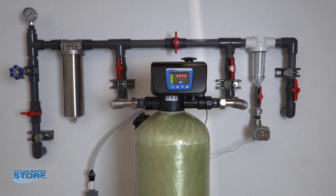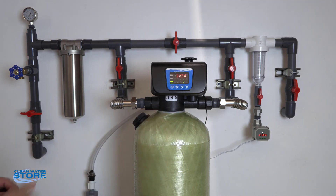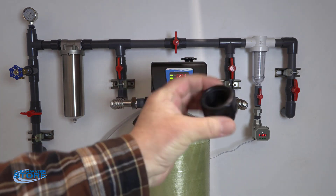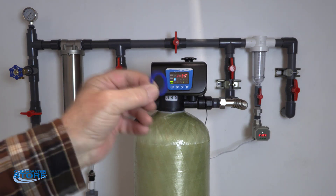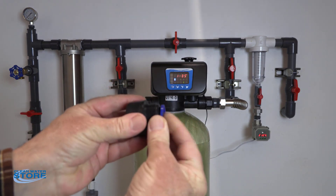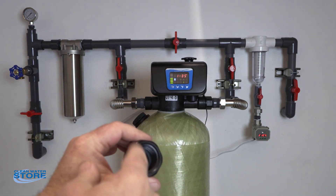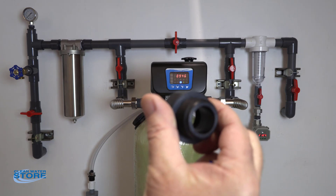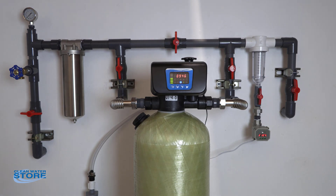When you're setting up the initial plumbing for the valve, your inlet side is over here — there is an arrow right here, you can see inlet and outlet. Your drain is in the back of the unit. All three of these ports have a fitting that comes in your kit, along with a blue rubber washer that seats up against this side of the fitting when it goes into the valve. Make sure you do all your taping on your pipe fittings prior to installing these into the valve. These only need to be a little over hand tight — if you over-tighten them you're going to end up cracking this and buying a new valve.